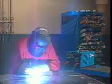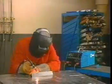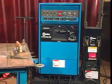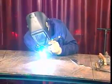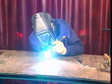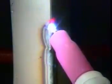For the most part, the equipment that is used to perform TIG welding is similar to that used for other welding methods. For example, a welding machine provides the current used to melt the metal pieces that are to be joined. TIG welding is usually performed with a constant current machine that provides AC and DC welding current. When using DC as the welding current, TIG welding is usually performed by making the electrode negative. This is commonly called direct current straight polarity.